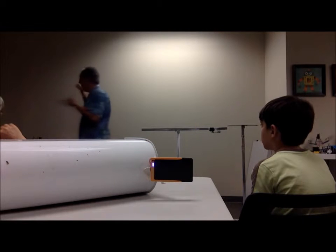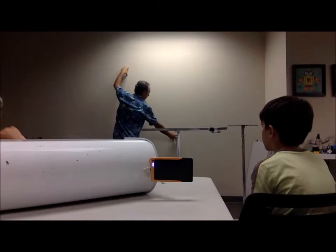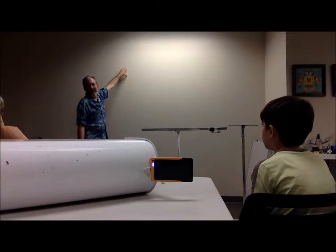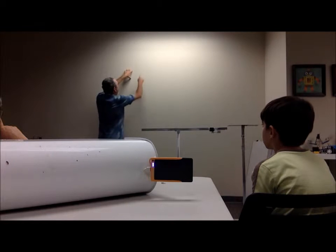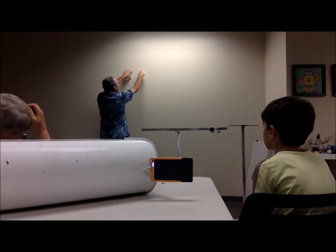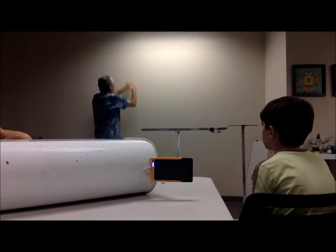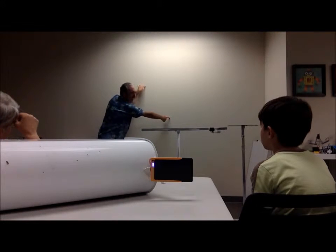So this mailbox, if you can imagine, I don't have a whiteboard, but you can imagine my house is on the top of a mountain, and the mailbox is down at the bottom of the hill, and there's a hill in between. So the mailbox can't see the house. There's no line of sight. So in order to actually get the mailbox to connect to the internet and be able to send me a text from my house, I had to build a router up in the eaves of the house, connecting to a router down at our gazebo with a directional antenna aimed down at the mailbox.